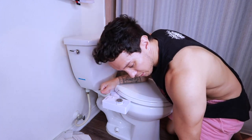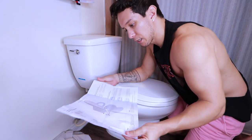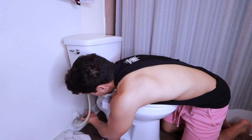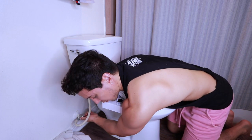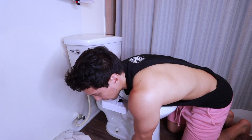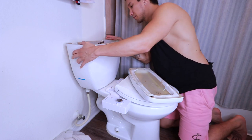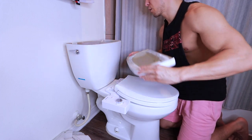Okay, directions — here we go. Turn off water valve. The valve is tight; there may be some mineral buildup. I don't know which way is off. Hopefully that's the right way. The directions say to go clockwise to turn it off. Flush your toilet to drain the tank completely — hold down the flusher until the tank empties nearly completely; a couple inches of water at the bottom of the tank is okay. Flush all the water out. It's not refilling with water, so that must mean the water is off.